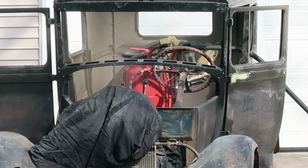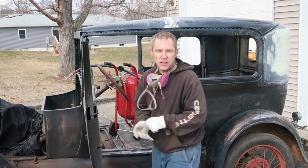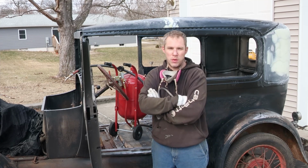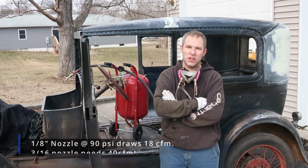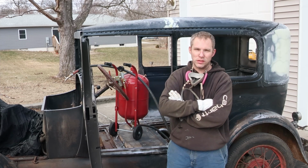That seemed to work out okay. I wouldn't do all this sandblasting unless you have a pretty good air compressor. I have 17 CFM. I want to run a big nozzle and get a lot of work done. I don't have enough air. Consider that before you buy a sandblaster.